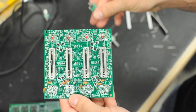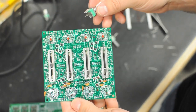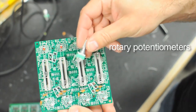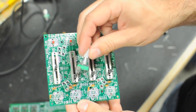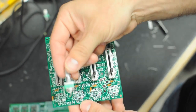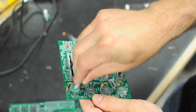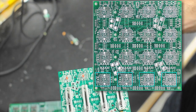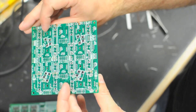Now that the 30mm faders are all soldered in, I'm going to put my rotary pots in. We're populating positions 13 to 16, which are clearly labeled on the front of the board, using these 9mm rotary pots. There's one way they go in — one spot is labeled 'pot' and one is labeled 'encoder.' Since these are potentiometers with ends (not endless encoders), go ahead and populate all four right where it says 'pot,' then solder all connections from the back.